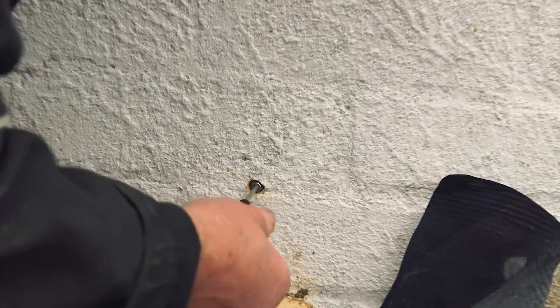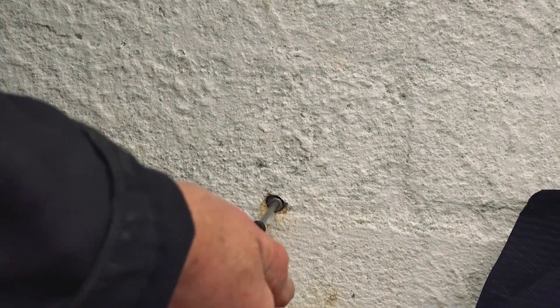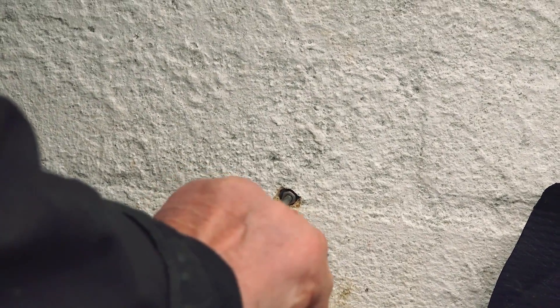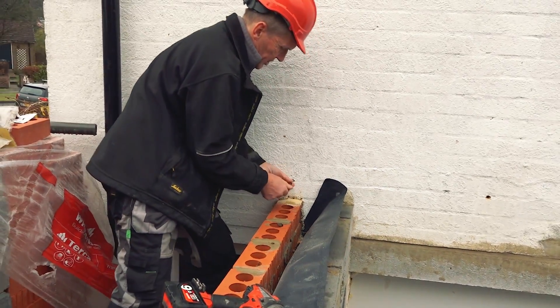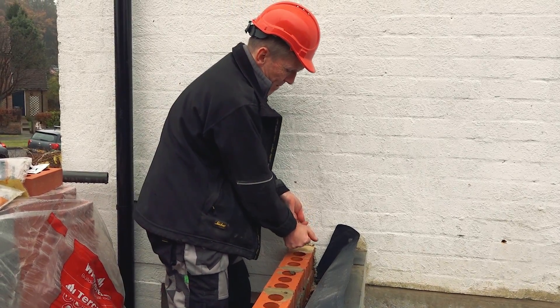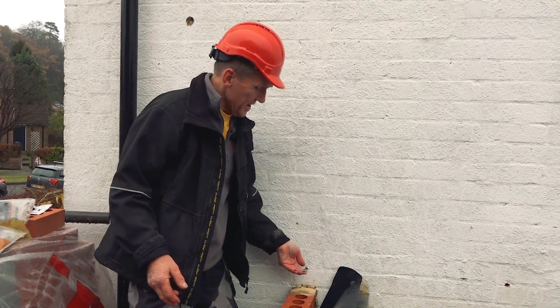You can see that it's just the friction of the plug grabbing on the fixing. Now when that tie is in, you'll see the difference between this and using a masonry plug, even though we're into the mortar course there. You can see this is absolutely rock solid as a tie, and the great thing is it's high quality stainless steel but if you're not quite right you can bend it, you can offset it to get you where you need to go.